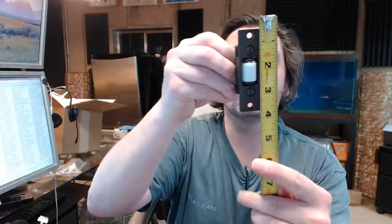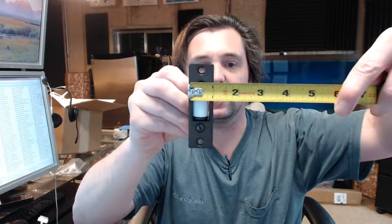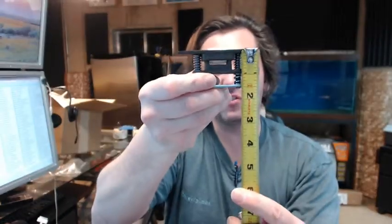There's a link below this video to the template. Let's go over the dimensions of this roller latch now. Overall length of the roller latch is about 3 and 3/8 inches — you can see there that that is indeed the case. You've got an overall width of about 1 inch, slightly greater than an inch. Overall height of about 1 and 5/8 inches.